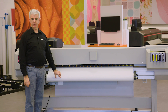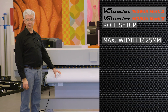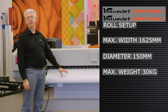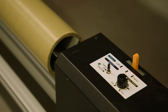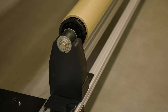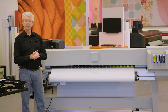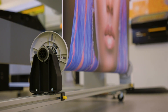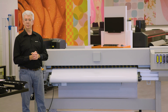The UR machine takes only roll media. The roll media can be up to 1625 mm wide, a maximum diameter of 15 cm and a maximum weight of 30 kg. On the front side you can have different winders: there is a 30 kg winder for people needing a winder but not necessarily handling full rolls. When you handle full rolls, as UV ink does not evaporate, the roll becomes heavier on the front side — in that case you preferably need the 40 kg winder. Top of the list is the 100 kg winder, which can take thicker rolls on the front and on the back, 100 kg in weight and 25 cm in diameter.